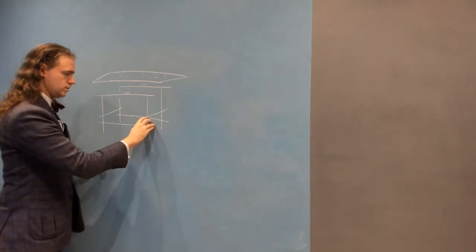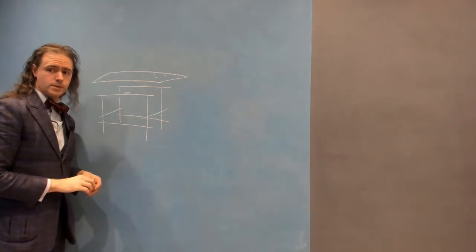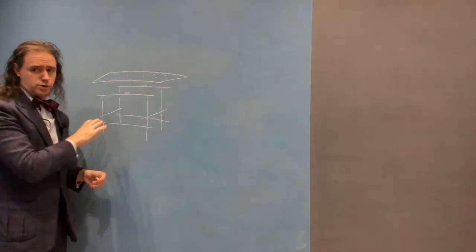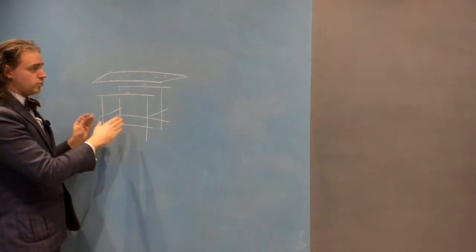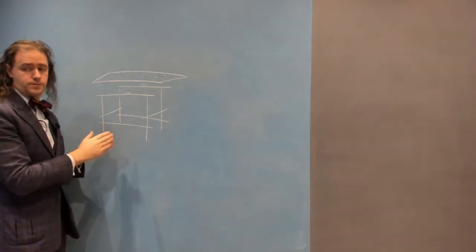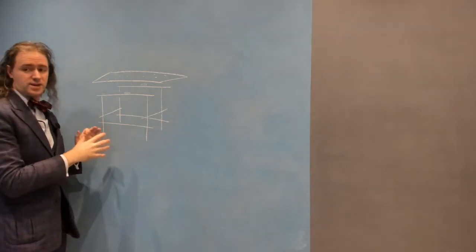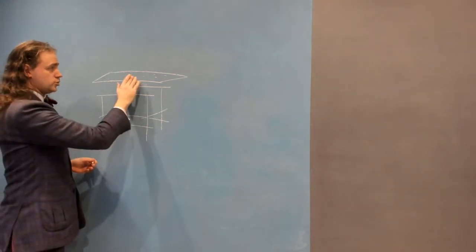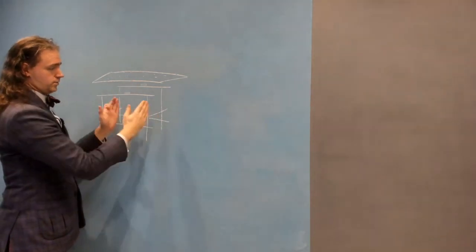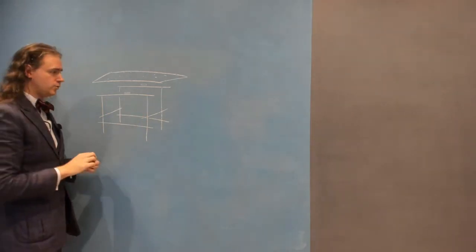And there's also going to be a couple of other pieces of wood making shelves at the bottom. And also possibly giving it a bit of rigidity side to side. But the idea behind this is any one piece of wood can shrink along its width, as wood does when it dries out, and the whole structure will stay reasonably stable. In fact, even if the bench top shrinks, which it shouldn't, it'll just cause the stretchers to arch a bit and be even stronger than it is now.